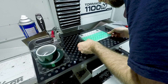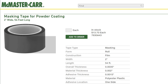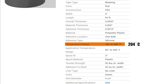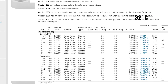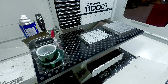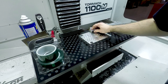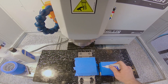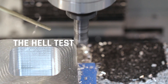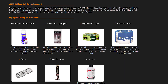The latest and by far the best tape we've found so far for the superglue tape trick is PET-based masking tape that is meant for powder coating. It's good up to 400 degrees Fahrenheit versus regular masking tape's 90 degrees Fahrenheit, so if you have any heat buildup in your part you're not as likely to throw it, and we found it holds up extremely well to coolant. We'll have a full video out on this new tape soon, putting it through the same kind of tests we did in our first video on this trick. In the meantime you can follow the card over to our page on the NYC CNC site for links to all of the supplies that we're currently using here.